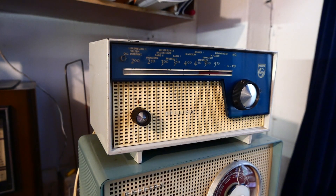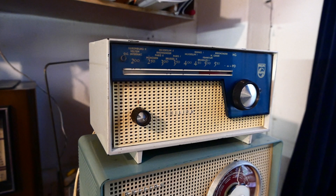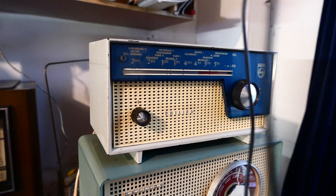The reception on the internal antenna is really quite bad. I'm now going to add this active loop antenna with one EF80 tube over here. It has an external antenna input but no ground input, so I'm just going to put the ground lead under the radio so it has some capacitive coupling to the radio.